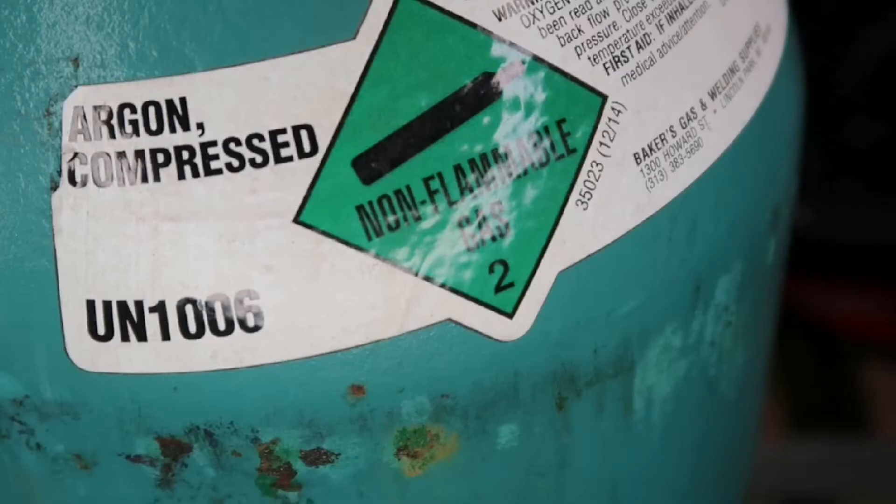I can blow O's. I usually have my salamander running, but it is loud and I don't want to talk over it. What we're going to be doing in this video is welding on that 110-220 multi-process machine — in my case the Fronius machine — and we're going to be welding aluminum. We have two different gas mixes to test: 75-25 helium and 100% argon. Typically when you're welding aluminum MIG or TIG, you're going to be using 100% argon.